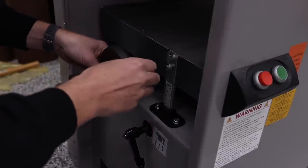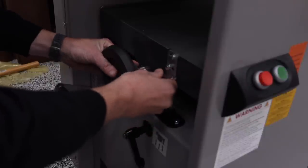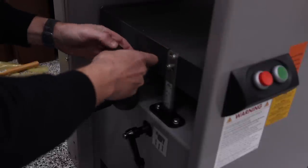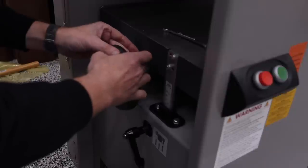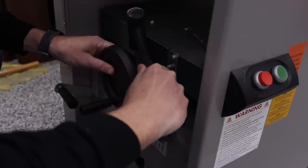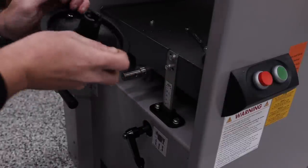If you are somebody that decided to get the digital wheel, I'm gonna go ahead and walk you through how that gets installed. On the back side of this wheel, there is a 10 millimeter nut. And all you have to do is loosen that nut. Once you get the nut off, you can push the bolt that's back there through. You should be able to hammer that screw down. And then it just comes out and this slides off.